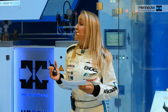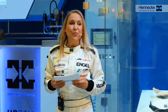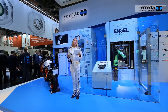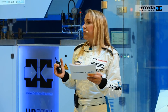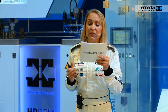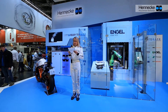After completing these first two processes, you get the pre-form. This pre-form is the final workpiece for the high-pressure RTM process. In motorsports, many parts are made from carbon fibers and were produced in the so-called resin transfer molding process. A pre-form is placed into a mold and soaked in reactive liquid. Typically, cycle times for such parts require several hours.